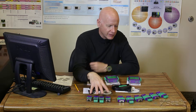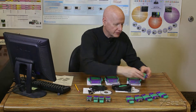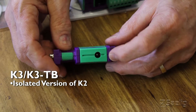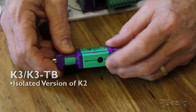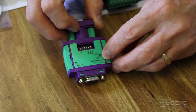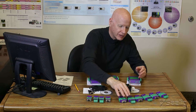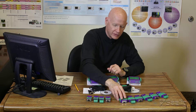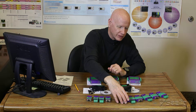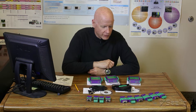The inline converters come in two general families: the non-isolated kind and the larger isolated ones, which have a few more components and are slightly bulkier. The isolated units can be powered by a small coaxial DC jack, and the polarity and voltage are given right on the back of the unit. These K3 units perform similarly to the K2 units but are isolated, and they come with either two DB9 females or terminal blocks.